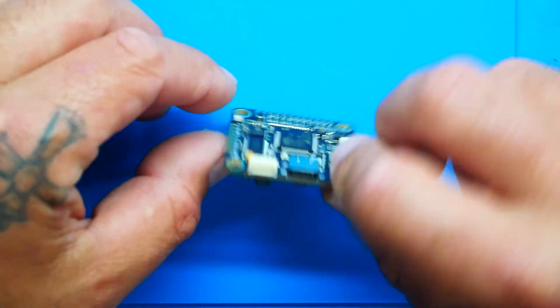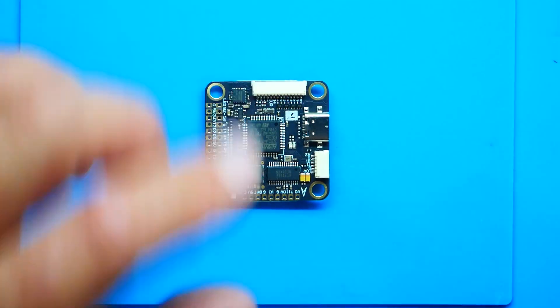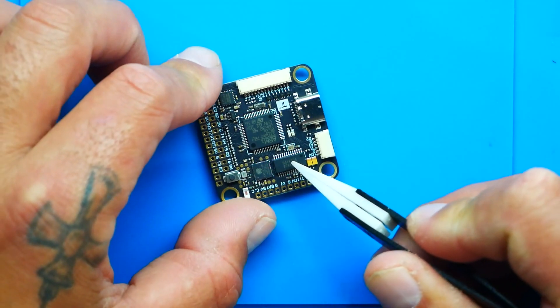On this side, there's a DJI-specific plug. There's also a USB-C connector — faster, sturdier, and all-around better. In your black box, you've got 16 megs of flash, which is very nice. For analog pilots wondering about OSD, there is an OSD chip on board. And you've got six UARTs because this is an F7 microcontroller — more processing power, more speed, and plenty of UARTs for connecting GPS and other peripherals.